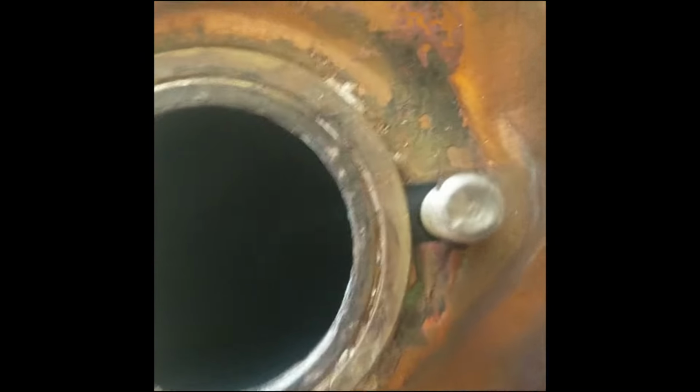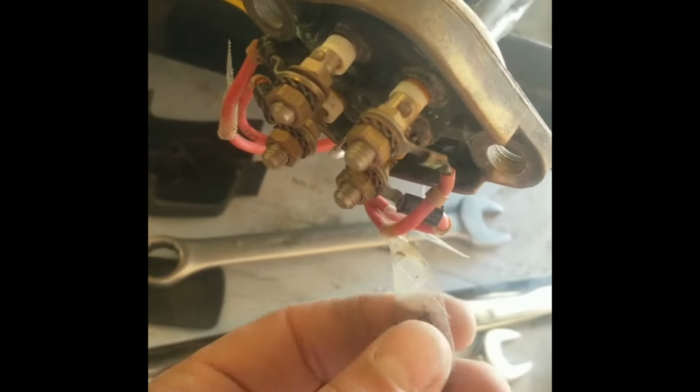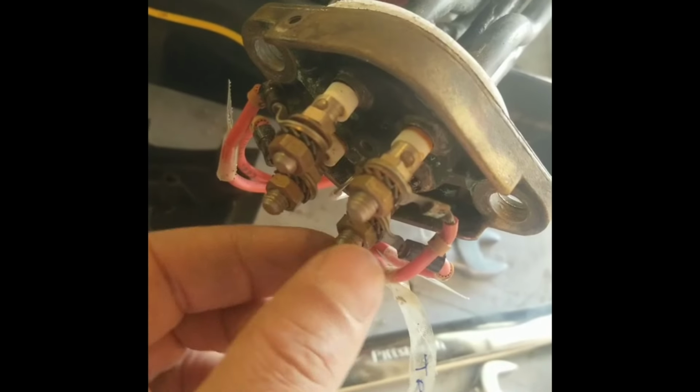So I did, took it all apart, pulled the boiler out, dipped the boiler in citric acid over a couple days, washed everything out, put it back in, redid all the gaskets, put a new vacuum breaker in it, some new screens, and then just generally cleaned it. Once I was done with it, I sanded it down and put a new coat of paint on it.